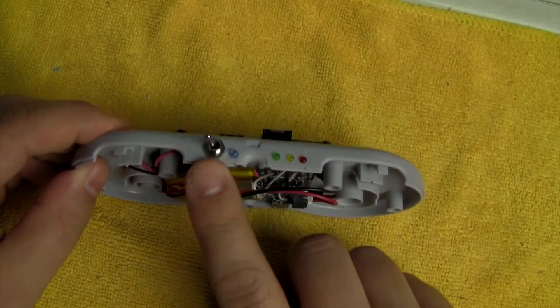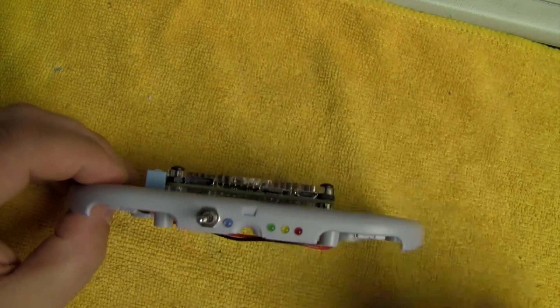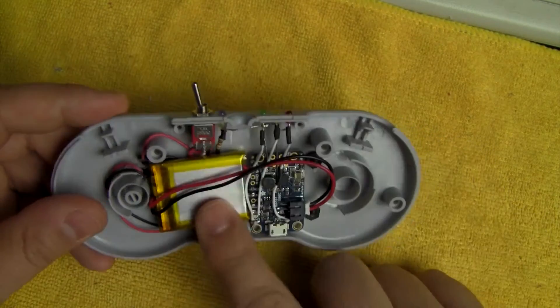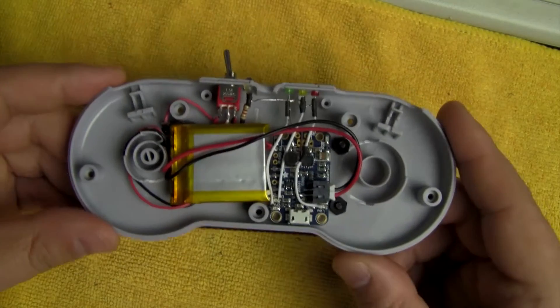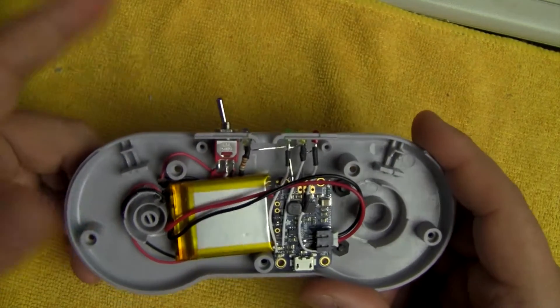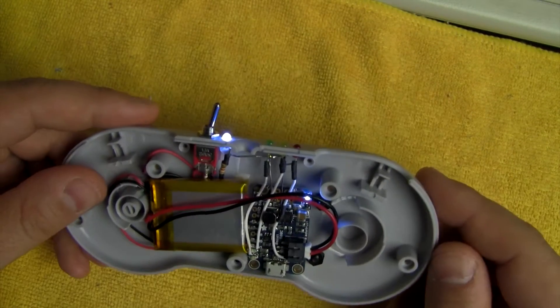In this position the unit is basically off, although if you plug a USB cable into the Pi Zero and run that down to your computer, it would turn the Pi on and start charging the battery — and the benefit of that is you can play and charge at the same time. Otherwise the normal operating mode is you turn the switch on, it turns the booster on, and you're running off battery.